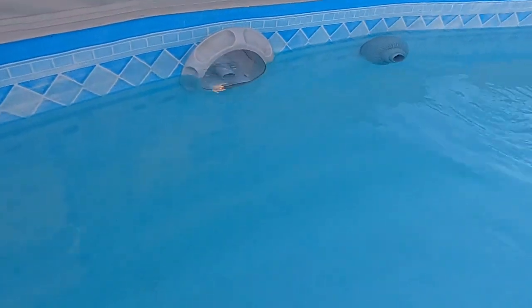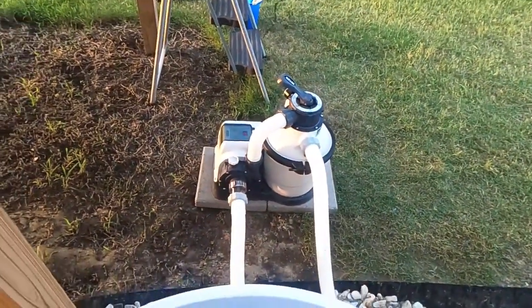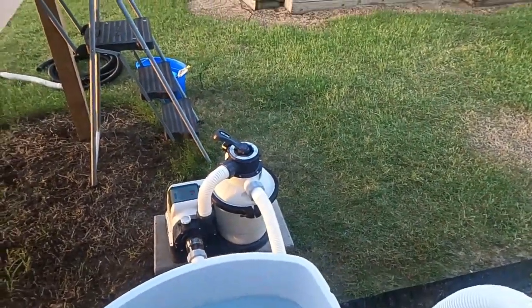Okay, so I have finished vacuuming the pool, and I cleaned the sidewalls, which after I vacuumed, I should have done before. It's got a few things lingering now in the bottom, but I have finished. It only took me about half the time as it normally would, but as you can tell, super clean now. Everything looks so good. I'm so happy. So next, what I will be doing is taking the vacuum adapter out. I am going to be cleaning out the little filter down there that has leaves in it, and I am going to backwash and rinse before I start the filter again.